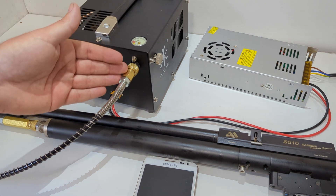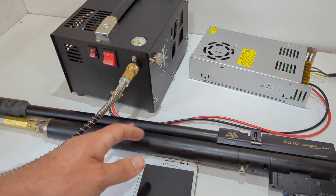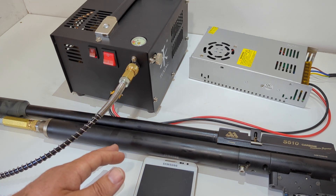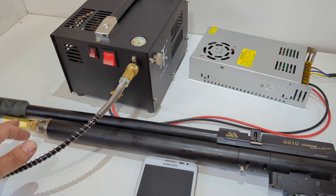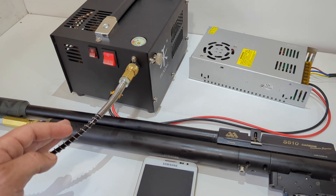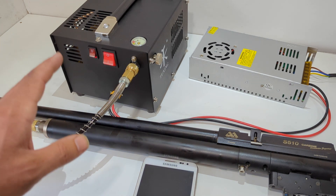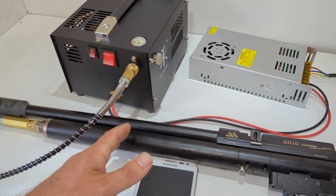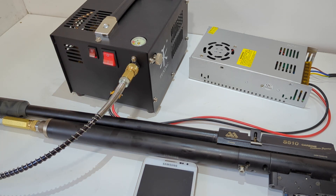Right, we're all connected up. We've got the little fill whip on, foster fit straight on the end of the S510. I'm very happy that the cylinder itself is in good condition. I would absolutely not recommend doing what I'd been doing on that other pump — high pressure air is no joke, you definitely need some filtration. Something's better than nothing, but bigger's always better in this instance. This fill line will be swapped out for a better one, although I'll keep this one probably for filling the S510 to do periodic check-ups and see how often these filters need changing. We're going to go for 180 bar, that's 18 megapascals on here. I'm going to do it in a time-lapse with the stopwatch, and we can see from empty how long it takes.